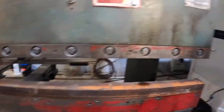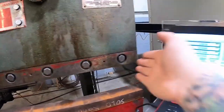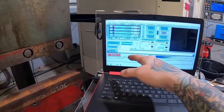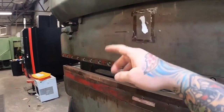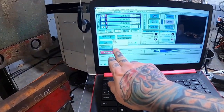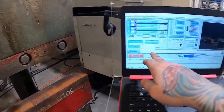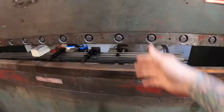That's pretty much as simple as it gets, and it's complete. I'm going to do some wire loom over some of the cables and get a box over the controls, but other than that this is it. There are a couple other things I could do, like put a limit switch on so when it goes down and comes back up it'll move to the next position. Or I can program in stops — G0 whatever, then a pause for five or ten seconds, then it moves to the next position. There are multiple ways to do that.